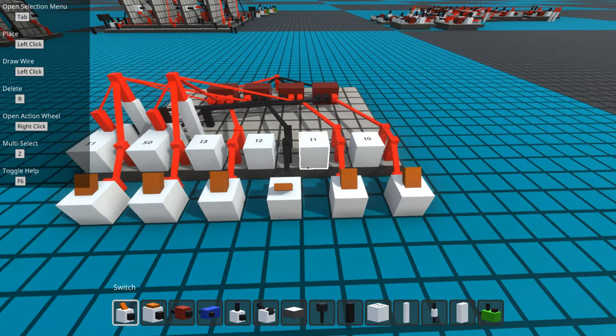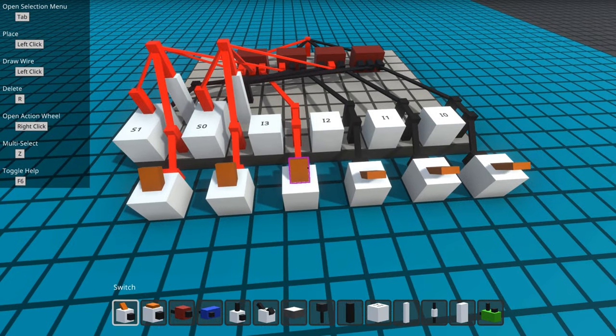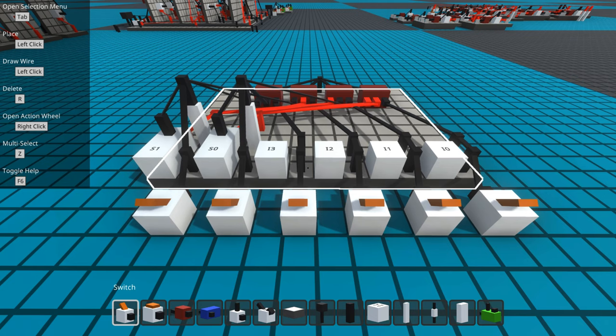Hello. The purpose of this video is to show a multiplexer — just turning off all these switches here. A multiplexer is a simple thing. It has multiple inputs and an ability to select which input you want out of those inputs. This is a 4-bit to 1-bit multiplexer. I'm going to select one of four inputs and put that on the output, and that's all there is to this.